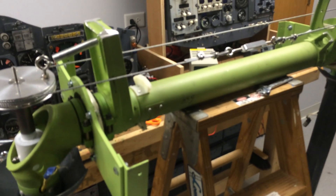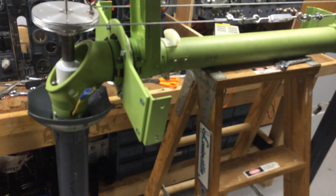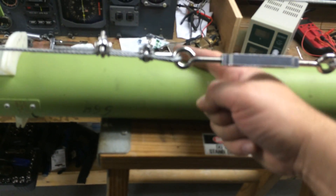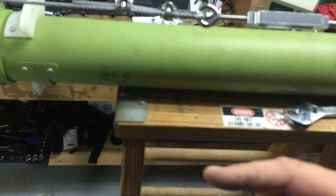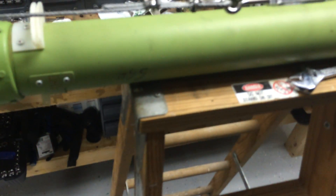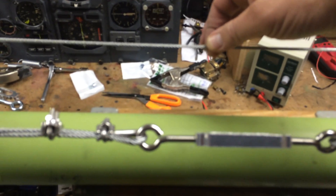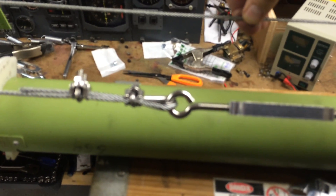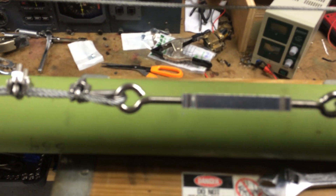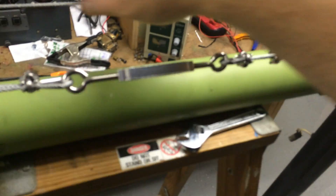As far as the pots are concerned, I'm going to probably put a string pot attached with a cord wrapping around the column, and coming off to a string pot. So when you move the column back and forth, it just pulls against the string pot for the roll axis. I'll probably put some kind of clamp on the wire and attach a string pot going off to one of these arms over here, and that'll give me enough for the roll axis.